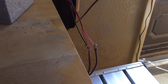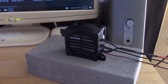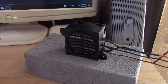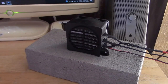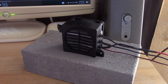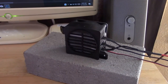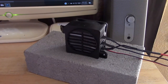One last thing to mention: don't use two panels — hook both sets of wires to one panel. The reason is that the heating element and the fan communicate with each other. I had read that but didn't believe it, but now that I'm using one panel, the temps are totally consistent. The fan will speed up or slow down depending on the temperature of the heating element — slower when cooler, faster when hotter — so you get generally the same output temps all the time. With two panels it was jumping from the 90s up to 150 or even 170°F. With one panel, it holds steady at 110°F — that's like low furnace temps, and it feels just right at two to two-and-a-half feet away.